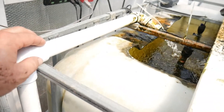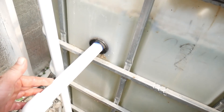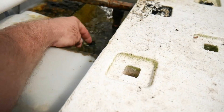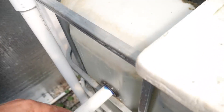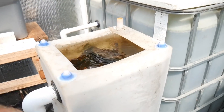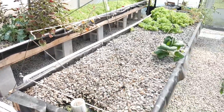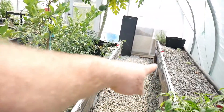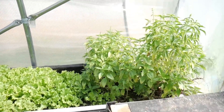This is the only tank in here that has a pump on it, so I'm pumping the water out of the sump tank back into the fish tank. Right here is just an automatic fill — it's got a float inside that keeps the water level up. This line here is an overfill line in case something stops up: all the water coming out of the sump tank can drain back right there into the sump tank, so if not enough water is coming from the fish tank to supply the beds, the extra goes back into the sump. Every one of these grow beds is set up exactly the same — headers flow down to the end and drain out.